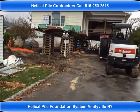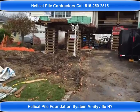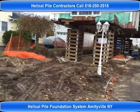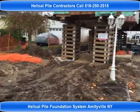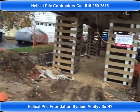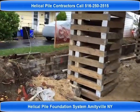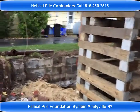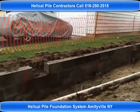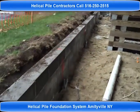We have been working here for the past two and a half days installing helical pull-down micro piles underneath this existing structure. We are retrofitting this existing structure to accept a new elevated foundation, four or five feet by two feet above the BFE.